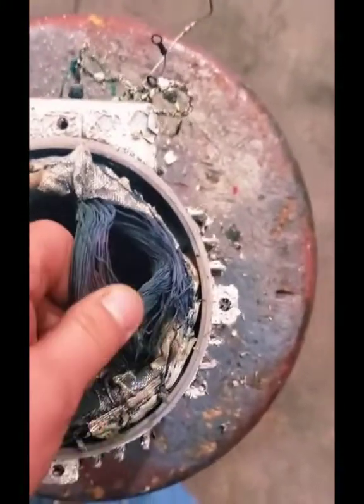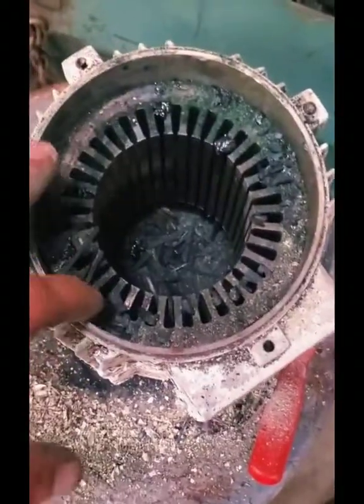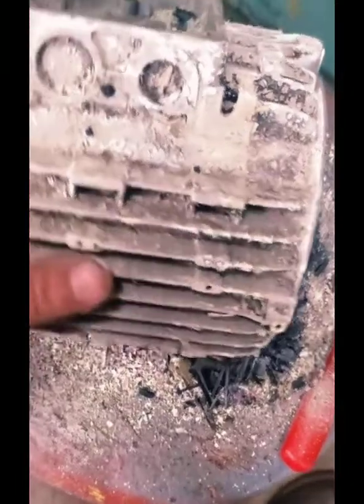You can see the copper at this point is pretty soft. I can start pulling it out of the slots, count the wires, and identify the connection. After we get all those wires out we got to clean the stator up so we can prep it so I can start putting all the wire back into this thing.